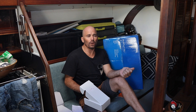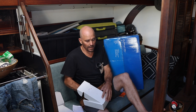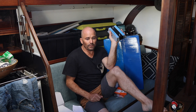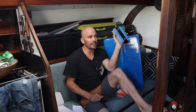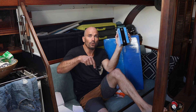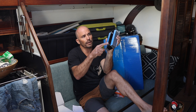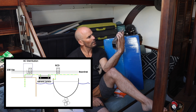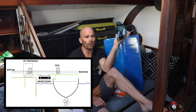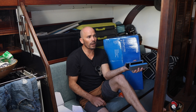My current battery bank is 12 volts, so the Multiplus is obviously not going to work with that yet. Now that I've got this galvanic isolator — galvanic corrosion is basically just stray currents, possibly from other boats or whatever, finding their way back through your boat to shore power. This essentially disconnects your earth wire — your earth wire comes in here, is disconnected through some sort of transformer, and then off to shore power. It literally disconnects your earth physically from shore power.